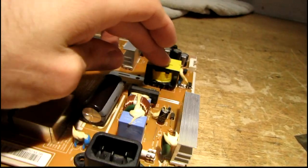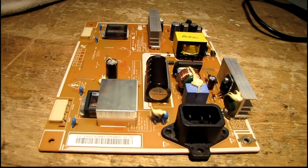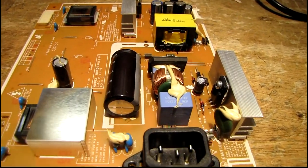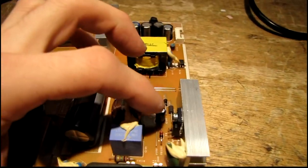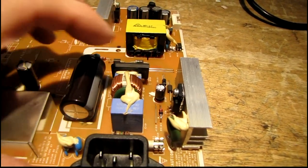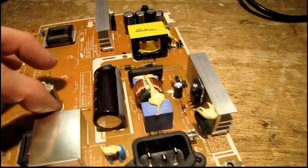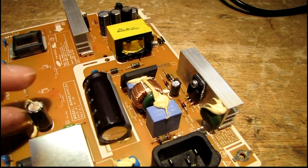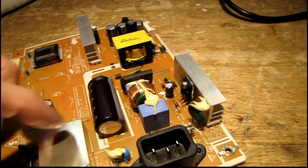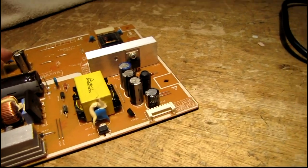As long as this transformer isn't shorted or anything like that — I really hope it isn't. So far so good. I've got those parts installed and I also ended up replacing this 47 microfarad 50-volt capacitor that was right here; I used a Nichicon PW series. I just wanted to make sure that wasn't one of the reasons the chip had gone bad, even though the cap tested okay. I powered it up through a current-limiting light bulb just for safety's sake and got 14.7 volts DC at the output.